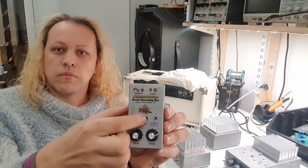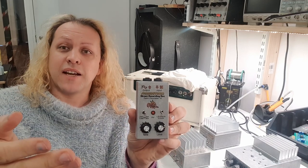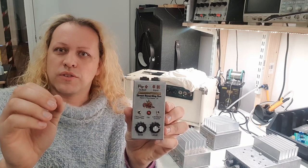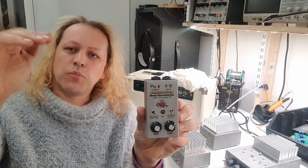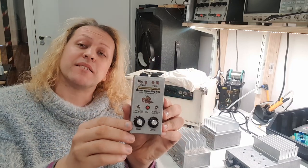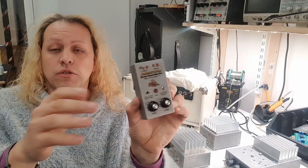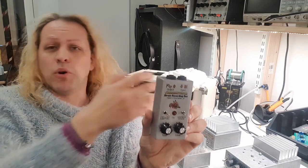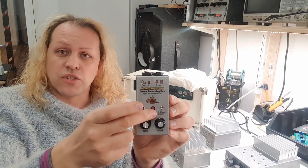That little bit of voltage is filtered through the tone control. It can also theoretically clip — if the voltage goes too high we don't want to accidentally send too many volts to your expensive recording gear. This limits the output to around two volts no matter what you put in. If you have your stack at full power with hundreds of volts and the settings are wrong, this will light up orange and say 'protected' and protect your recording gear. If a line out were built into these units, it probably wouldn't have that protection. So you've got the tone filtering, the protective clipping on the output, and also a ground lift.